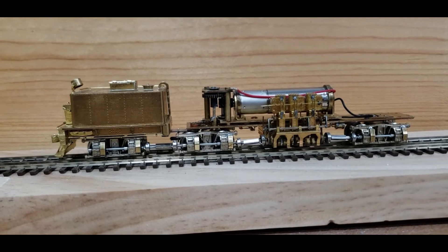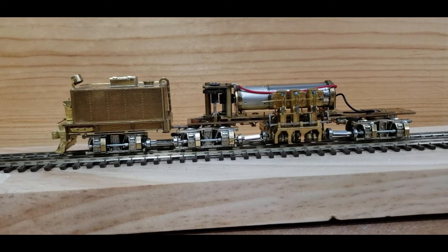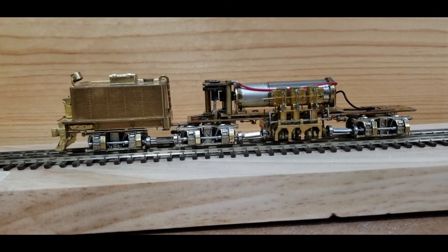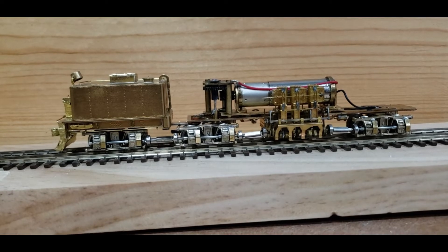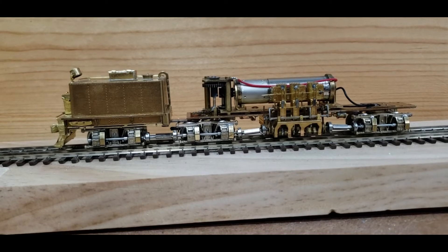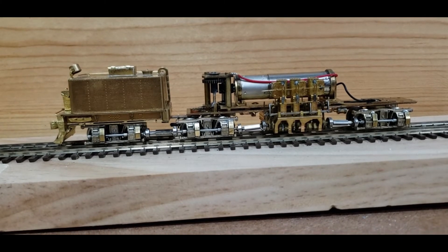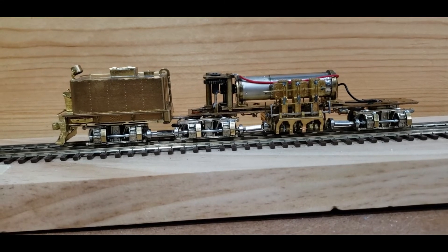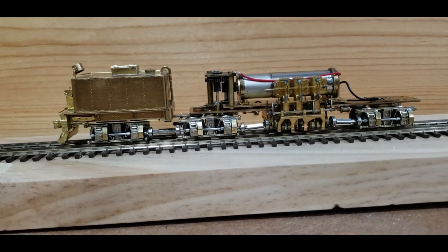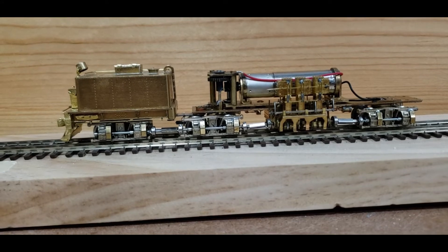One of the fundamental problems is that vertical shaft tries to twist the truck — that's a torque reaction. The truck wants to twist whichever direction the shaft is going, and that causes a number of problems, including the truck trying to lift when approaching switch points, which causes derailments. This is the classic problem with this era of Westside Shays.